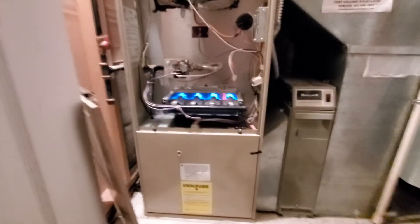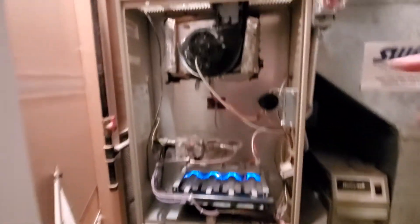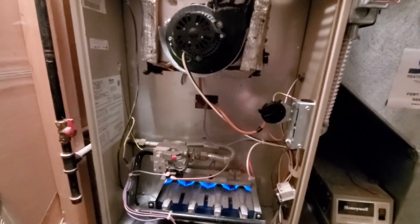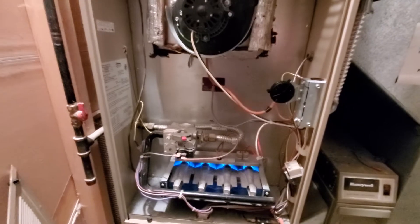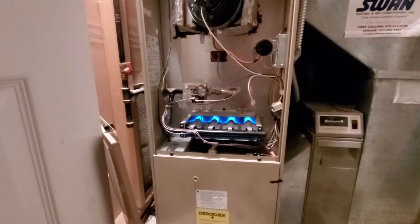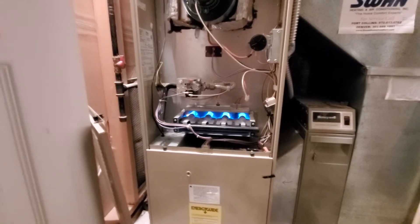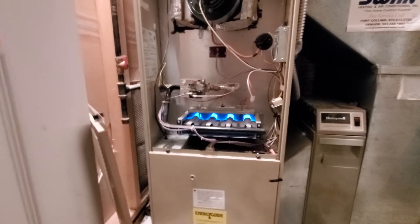The issue is actually down here in the circuit board. The reason I know that is because the induction motor right here won't shut off even after the furnace reaches temp. I have it set to 70 or 72 — when it reaches that temperature it will kick off, and the induction fan will run for a while to clear out the heat and gases from the heat exchanger, but it never shuts off. That's an indication there's a bigger problem than just the pressure switch.